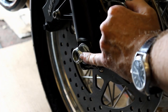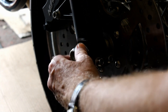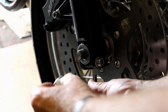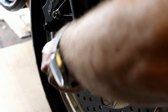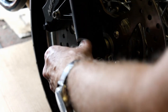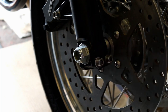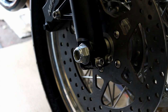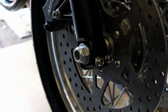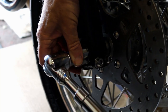I wanted a stainless steel version but one costs about 20 pounds, which is ridiculous. I hit a problem though, because this is a nylock nut and there's not enough thread to bring the nylock into play. So I took one of these nuts to the workshop and machined off about 4.5 to 5 millimetres off the end, so hopefully this shorter nut will go on and engage the nylock. Yeah, that's better. I could also remove the thick washer behind it and fit a thinner one.